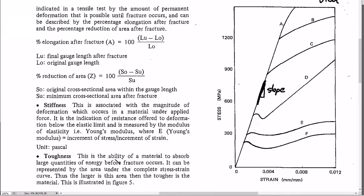There are different metals here labelled A through F. F is the softest but very ductile — it continues along for a long time and may have stretched nearly 20% before it breaks. Metal A is a very hard steel that snaps right at the top of the curve. The mild steels at the bottom have a very obvious yield point — the curve actually goes down after the yield point.